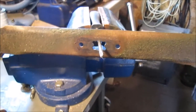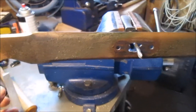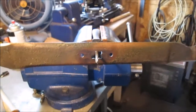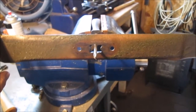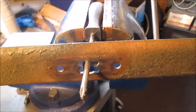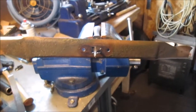Okay, we're done. Our battery symbol's showing up. I'm doing the old balance test with a screwdriver — it's kind of hard, it's got a funky groove in there, but it's close enough. You go like this and it goes that way. It's good enough for the old mower. If it were brand new, I might get a little picky. That's just a cheap, simple way to balance your blade — if you put it in and it tips like this, you better do something.